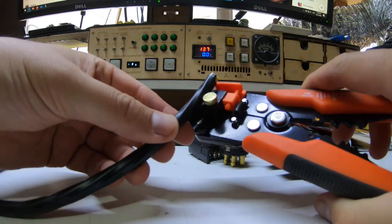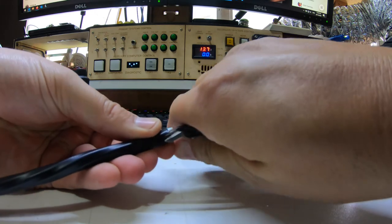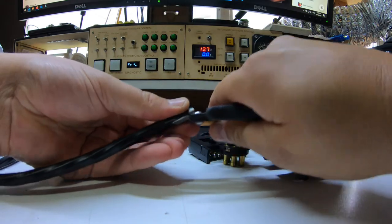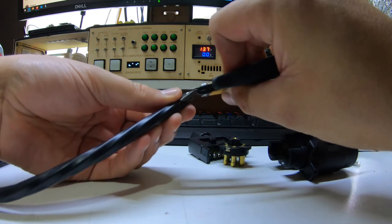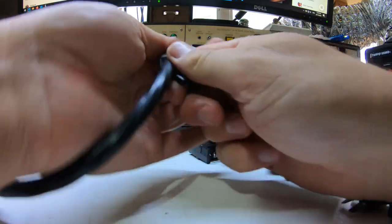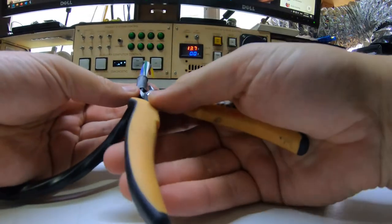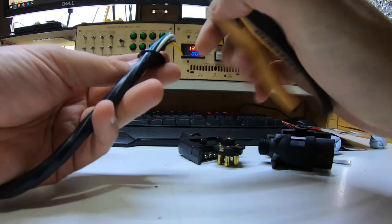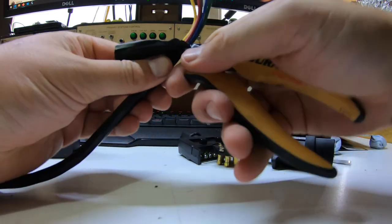Now obviously these things are not going to do the job - we're going to have to do this the hard way. You can do this with a knife but given my MS dexterity issues I think I'm going to take a slightly safer path. I am doing something unsafe here - pushing these in on the insulation towards my body, which is not recommended. I am being cautious about it and I've done this a lot of times before, but that doesn't mean it can't backfire. Now that we have this off we're going to give this a good yank. This is good quality cable - normally with the cheaper stuff you can just keep pulling and eventually strip down to the right length.